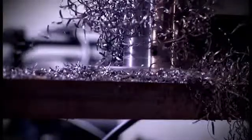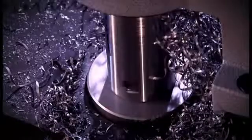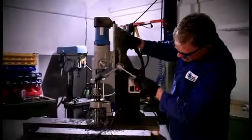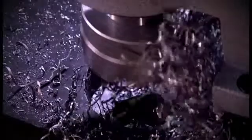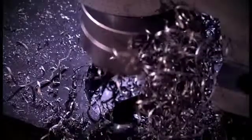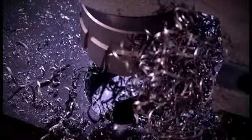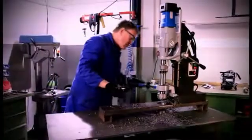Another recommendation: carbide tools are cooled with cooling lubricant BDS 6000. HSS core drills are lubricated with cutting oil BDS 5000, lubrication spray BDS 5200 or cutting paste BDS 5500.